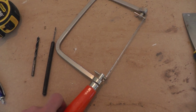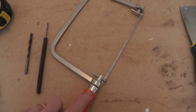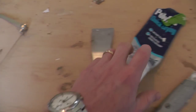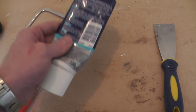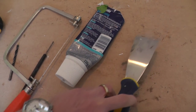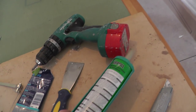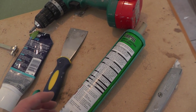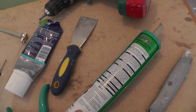You want to make sure you've got a good coping saw, and this will be really important when we come to do the joins on the corners so we can scribe over the moulding itself. A filler of some sort just to fill those holes so you can dry and paint over afterwards, and just a way of smoothing over the filler as well. And then obviously a drill to drill those holes. And lastly, just some construction adhesive so you can put a few dabs along the length when you put it up on the wall — that's just an extra way of making sure it's nice and fixed, and should you want to hang anything from it you know it's going to be strong enough.